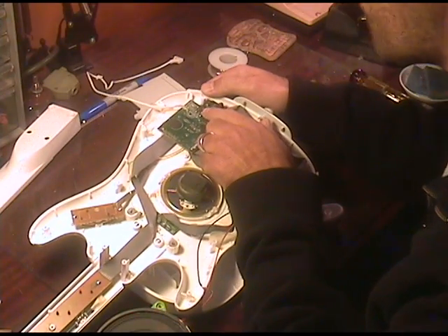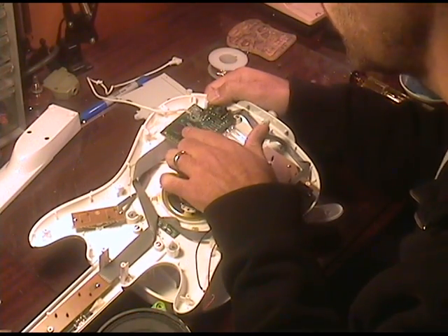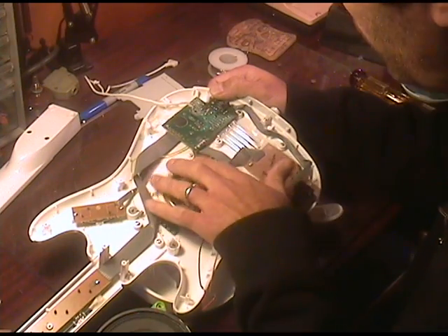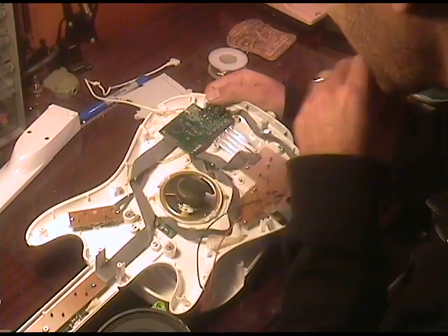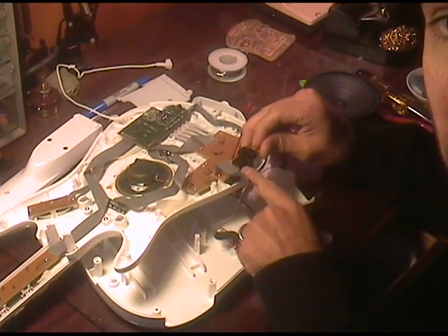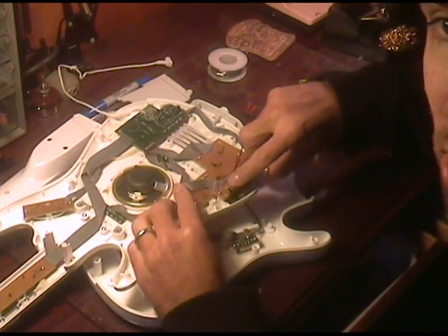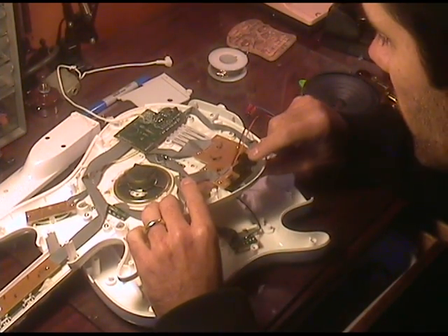I can see that there's a little tiny op amp and a black blob. Underneath that black blob is probably where the sample data is, and also the little computer that interprets the switching matrix that they've made. There's also a sing-along mic jack here on a tiny little board and the on-off switch. And a headphone jack, so I'll be able to tap that for an output.